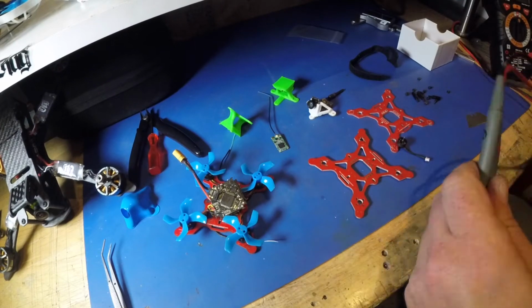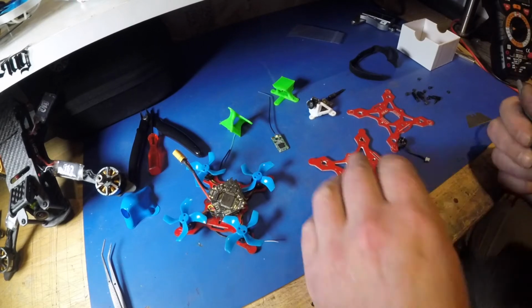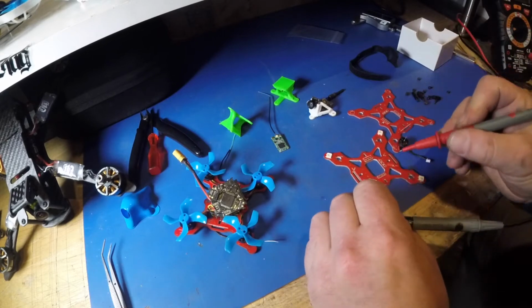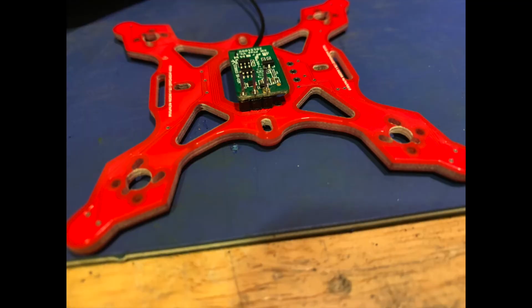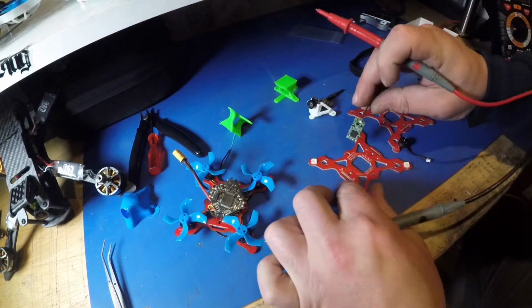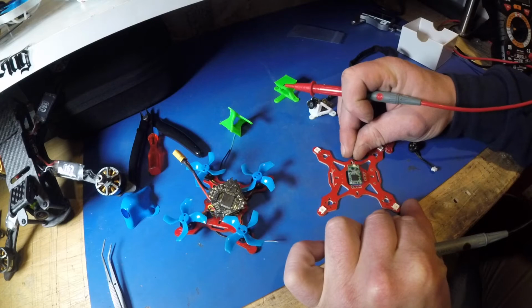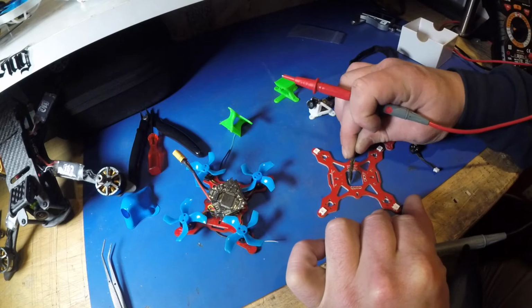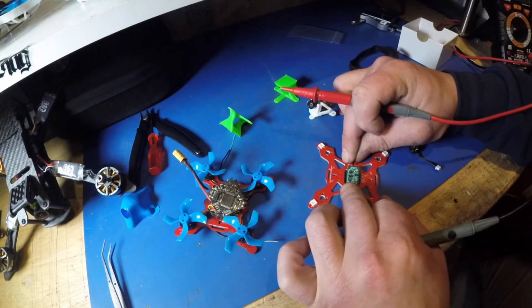Now I've made these, let's put the continuity meter on, just turn it over so you can see it this side. Basically, if you solder in a block of pin headers in here, you can hard mount an RX of your choice. You don't have to use them all. I've built in a bit of room so you can wiggle it side to side, and you can flip the side. I've got mine that way up actually, like that, and I only pick up the 3 connections.